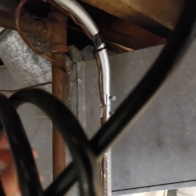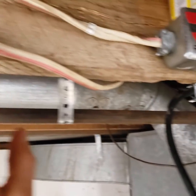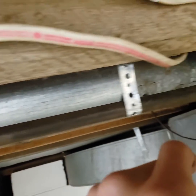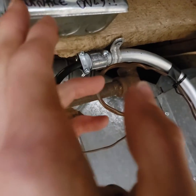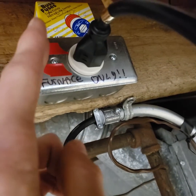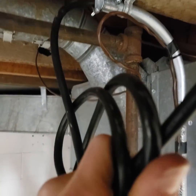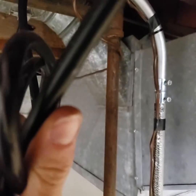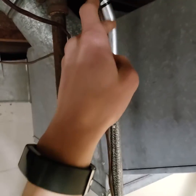There was that wire going up with it, and what I did — I have enough wire here I could hardwire it if I wanted to. It's 12-2 wire, just a 15 amp circuit. Instead of going into the conduit, I put an outlet here, which is a single receptacle, with spare fuses for the furnace. This is a 14 gauge cord from Home Depot. It's a 15 amp circuit, so 14 gauge is fine. Then it's coupled with just a 90 degree conduit fitting, and this goes onto the switch down here.